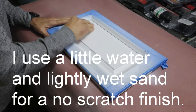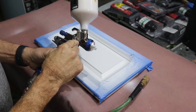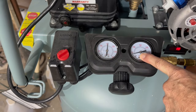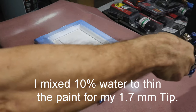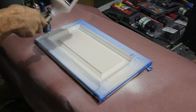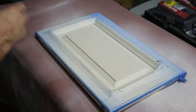According to manufacturer specs, you should use 320-grit sandpaper before you topcoat and in between coats. I'm going to use the HVLP with a 1.7 tip. I have 25 psi constant pressure — that means it was set at 50 psi and when I hold the trigger down constantly it goes to 25. I let that dry, came back and hit it again. I don't see any white, I don't see any primer — it looks great, but I'm gonna hit one more coat.